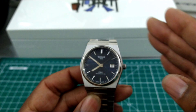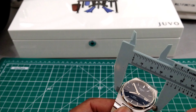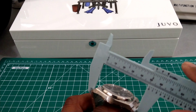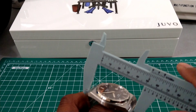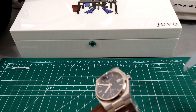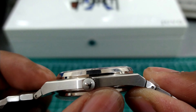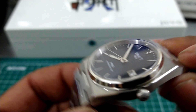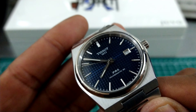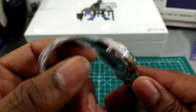This watch is just going to be a classic size. From the furthest points it's only about 40mm, and the lug-to-lug including the integrated lugs is going to be about 51mm. The thickness on this one is going to be a scant about 12 millimeters — and that's real nice. You get a really nice knurled crown with the Tissot logo on there, polished undercase, polished bezel. You get an all-brushed aluminum rehaut inside, and this dial is just extremely nice and striking. This is a sapphire top, mineral glass back.